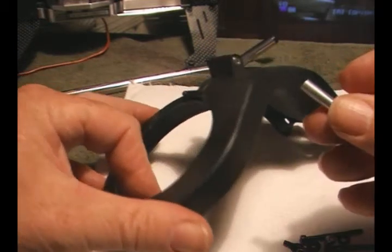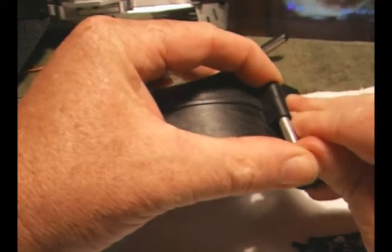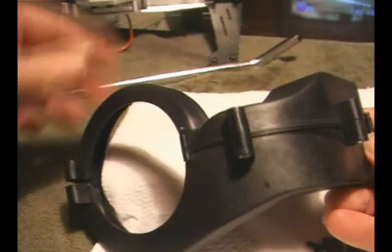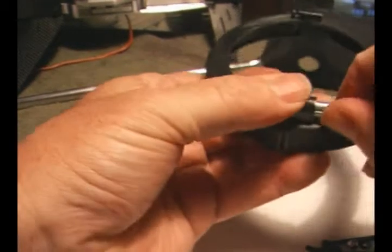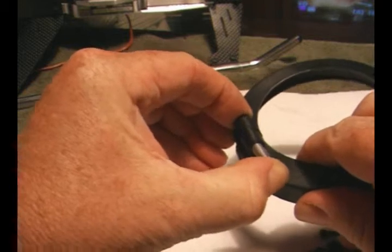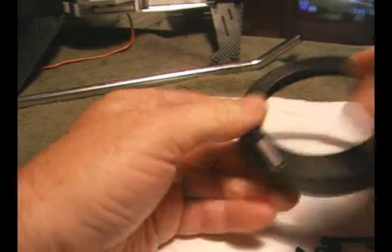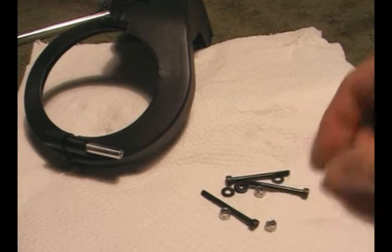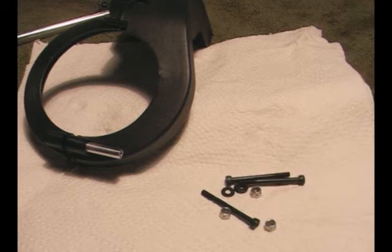This comes ready assembled. What we have to do first is we've got some frame spacers. We have to push 3 of these down into the mounting lugs. They're a bit of a tight fit, but once you get them started, they go down fairly well and get them in nice and flush. And once you've done that with all 3, you can then turn your attention to the frame, where they're going to be secured in with the mounting hardware, which is our M3 by 32mm collar bolts and their respective washers and lock nuts down there.